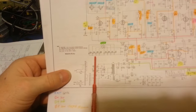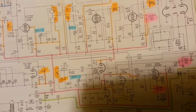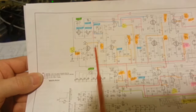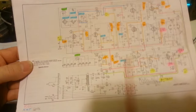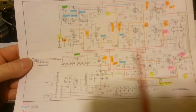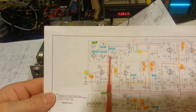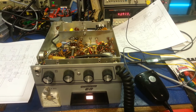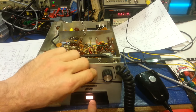They do it with 11 crystals. There are eight crystals in the 25 MHz range — from 25.405 down to 25.315 MHz — used for both receive and transmit. The receive circuit doesn't mix with another crystal; it has its own oddball oscillator circuit with no crystal. Our problem is on transmit: we're transmitting in the 25 MHz range and mixing with other crystals. The radio also has three bands, but not like a modern export radio. There are three rings and numbers on the channel dial — this control changes the actual channel, while this one moves the band window up and down.